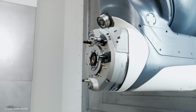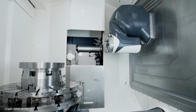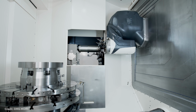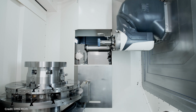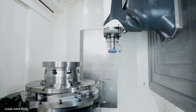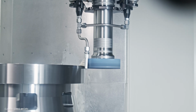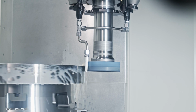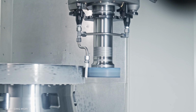And this goes on a CNC, computer numerical control machining center, a sort of machine that does milling, drilling, and in the case of this particular machine, grinding as well. So this adapter helps deliver coolant, cutting fluid to the cutting edge on a machine that has all those different kinds of tools in play, a milling tool or potentially a grinding wheel, and this adapter directs the cutting fluid to just the right place for all that different type of tooling.